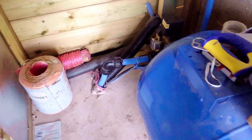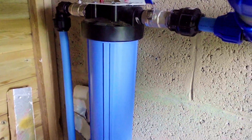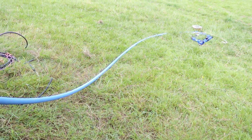I put it in a measuring bowl because I want to see how quickly it drags up the liquid, which will give me an idea of the litres per hour it can suck up and deliver through the irrigation line. That's the theory. Before I can do that I've just got to make sure all the plumbing in my pump house is watertight. We've got water coming in from the borehole through a little manifold, up into a primary filter, then out into a T-junction, rigged up so it goes outside into the venturi.